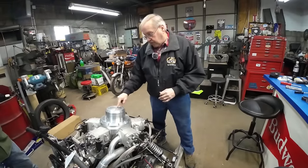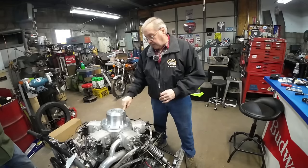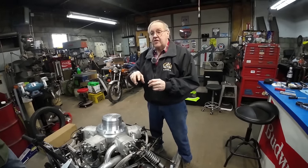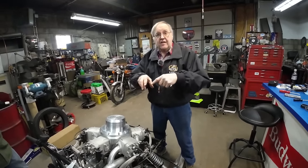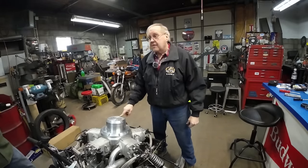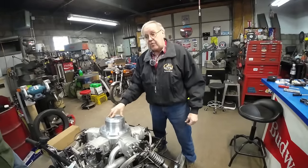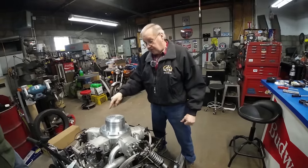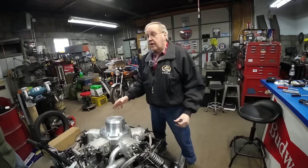I built a rotor with one magnet in it, and I've got 5 electronic pickups for an electronic conversion, like for a 57 Chevy where you pull the points out and you put this in there. You've got a little flying magnet to trigger it. I got that in here. There's 5 of them. As simple as hell, and it works. There's not much for an advanced curve or anything fancy, but it fires at 20 degrees before top dead center on each cylinder. What else do you need?